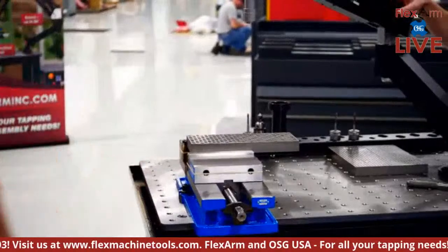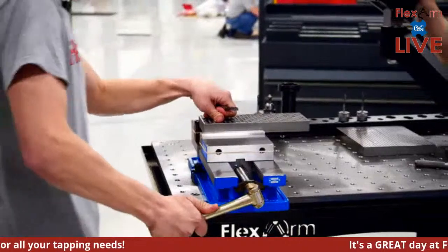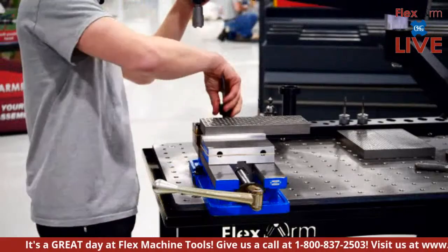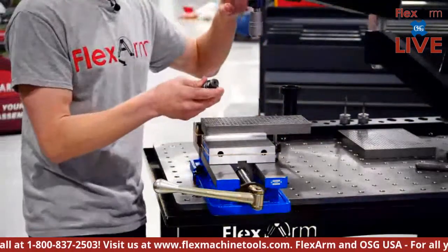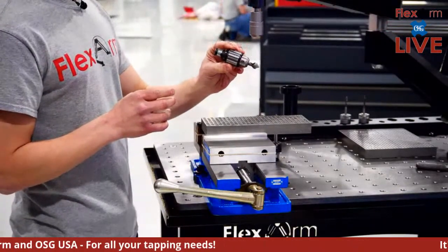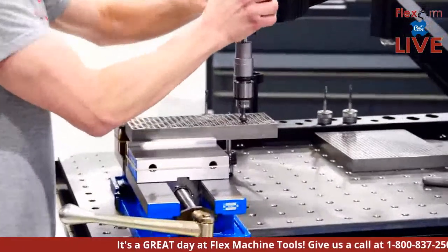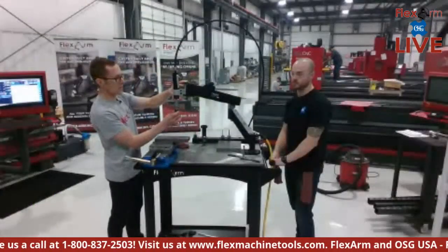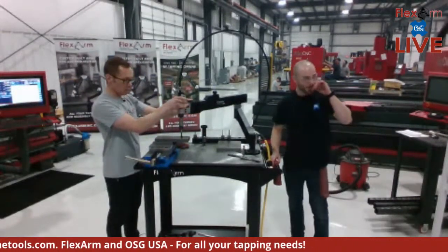You don't want to drop your tap. This A32 arm has up to 9/16 capacity in general mild steel, powered by pneumatic airline with requirements of 90 to 120 PSI or 20 to 24 CFM. We're starting with a quick-change chuck — chamfering these holes with a three-eighths Jacobs chuck going right into the spindle. I like showing the Jacobs chuck first as a quick-change option — bring it over, give the hole a little kiss chamfer.